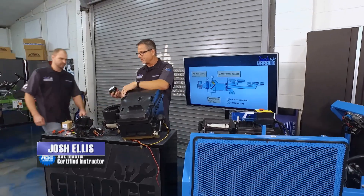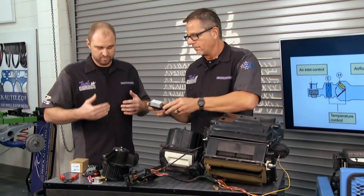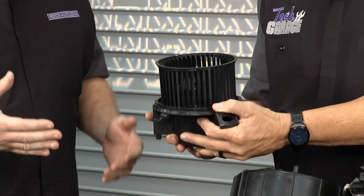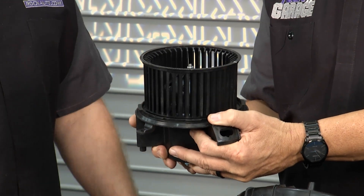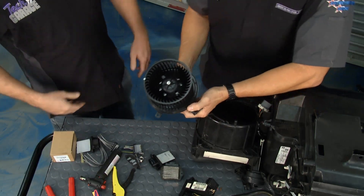A lot of places actually call this a blower control module. What it does is apply voltage at a specified rate. I like to use an analogy like a merry-go-round — as I'm pushing my kids around on it, if I just give it a little push every once in a while, it spins slow. But if I really want to sling them off, I just increase my pulse and go around and around — it just flies. That's pulse width modulation.